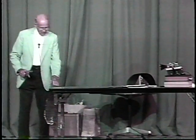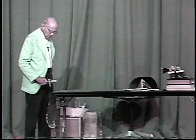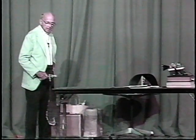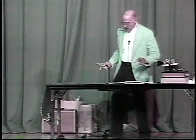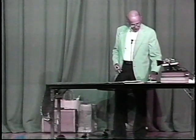You're out here at some distance from it, trying to get a good signal at your receiving location. And you find that at some heights, you don't get much at all. So you say, we've got to build a taller tower — yeah, that would help. But you could get the same increase by going lower; instead of adding on, you could take a saw and cut the tower down. Keep that in mind. You have spots where the direct wave and the one that's bouncing off the ground reinforce — that's fine. But where the two are in opposite phase, they cancel and you get no signal. And so you have to go up or down.